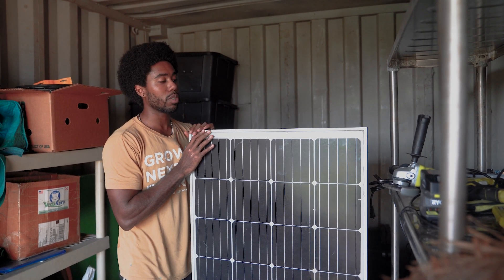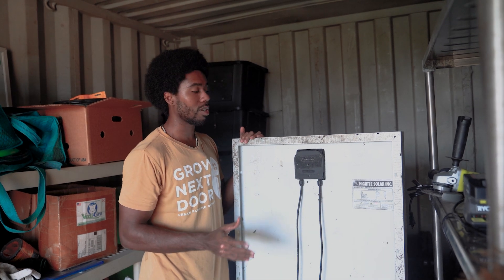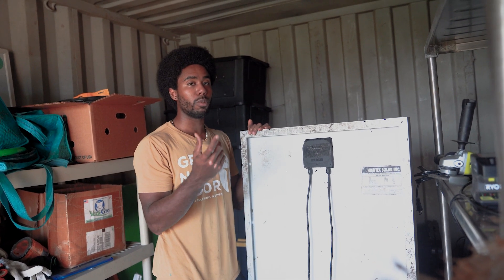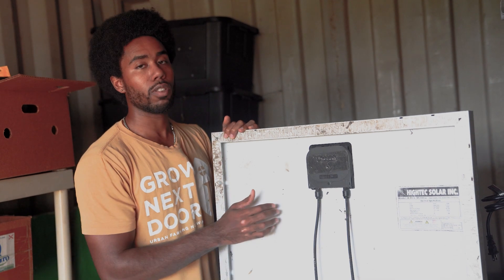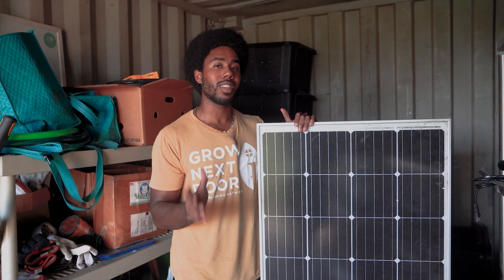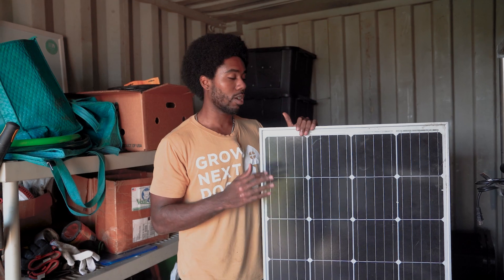These convert raw solar energy from the sun into a form of DC energy. I recommend getting yours — if you're going for your first off-grid system — by finding deals on OfferUp, Facebook Marketplace, or Craigslist. That's where I got these for very cheap. Just make sure they're not damaged; if they're connected to an existing array, verify that they actually work. You can do that using a multimeter and checking the box in the back — make sure to wear gloves, use safety precautions, and have the solar panel out in the sun. If you don't want to go through the hit or miss of used panels, I recommend Santan Solar — they sell $50 solar panels in bulk, 10 for 50 bucks each. I have the link in the description below.